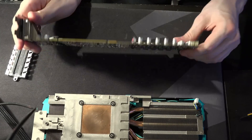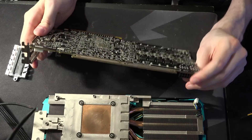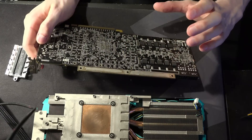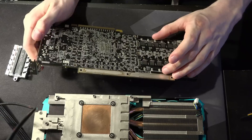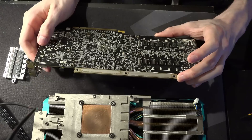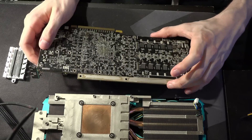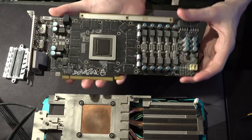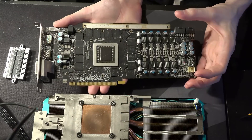The other thing I've done with the card is thrown a custom BIOS on it. All I've really done in that BIOS is change the memory timing — this thing is currently set to the 1375 memory strap. It runs great, all the way up to like 1680-something megahertz. It's on SK Hynix memory — I haven't tested the 1250 megahertz strap.